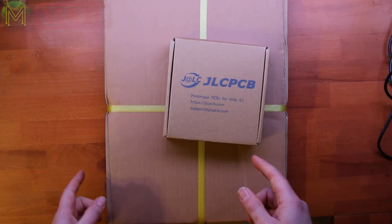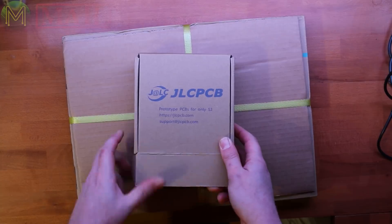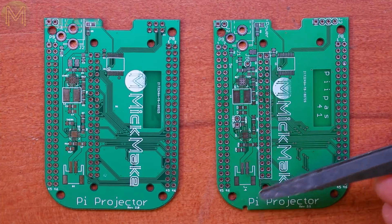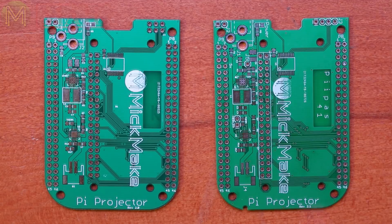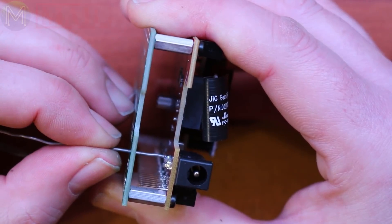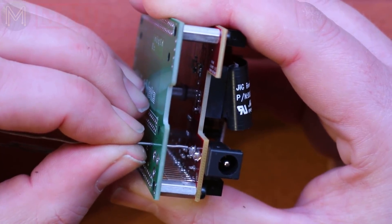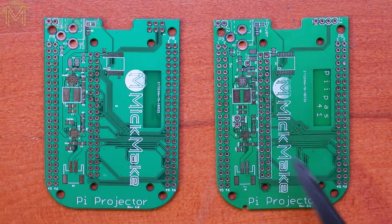This time I ordered a stencil. I was fairly confident with the design and it was all powering up without an issue, so I got a stencil and hopefully I won't have to have too many changes. Version 2.1 has a few changes: I've put a small notch in the front of the PCB so when you're running the LiPo battery it can sit underneath and not stick out the front. I've also added a jumper which allows you to connect up to the DLP2000 without having that top jumper — you can desolder your power pin on the DLP2000 and invert it around, then put a female header on this side and it'll just connect straight up.